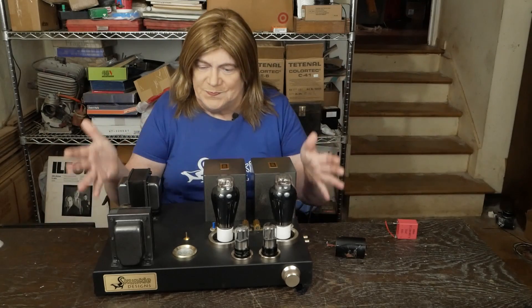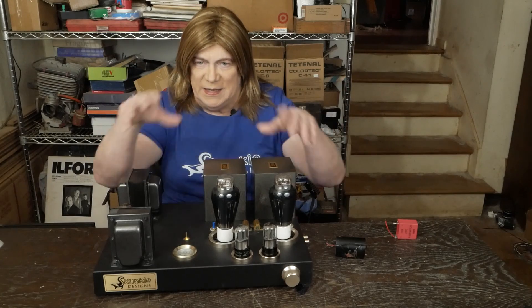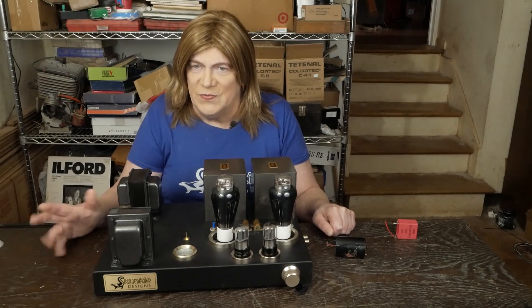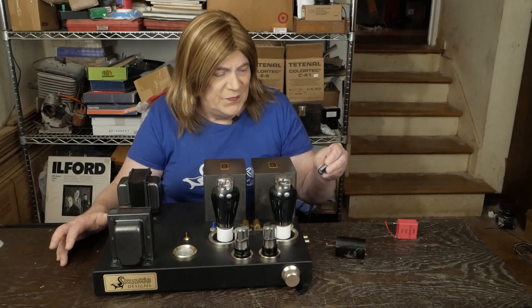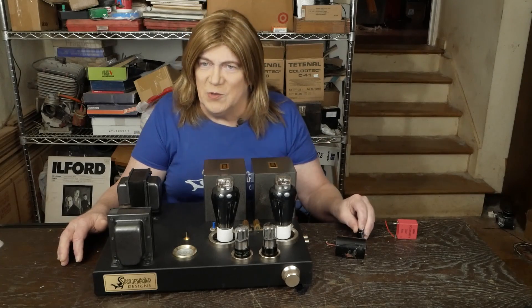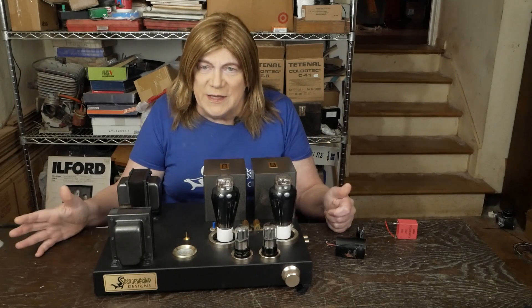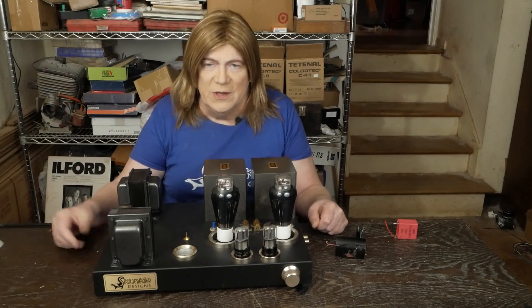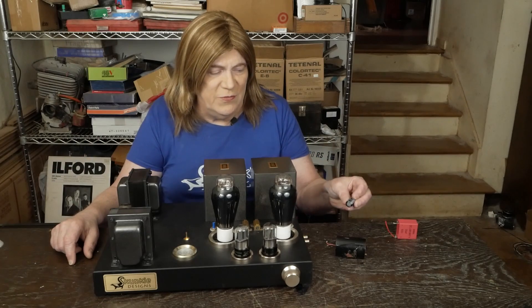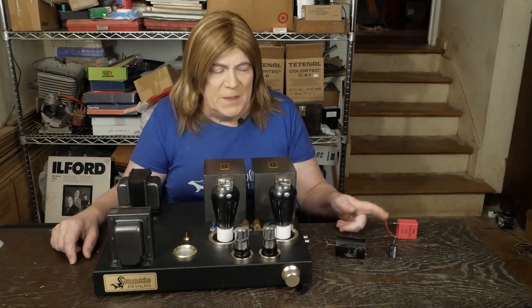When I posted pictures of the inside of the amp, somebody pointed out some cheap Chinese caps — Chenex electrolytic caps — on the front-end filtering. I figured they had a good point. I had nice high-end everything else; the other power supply caps were pretty nice JJ axial electrolytics and Nichicon. I looked through my stock and found a couple of 47uF 450-volt Nichicon caps, so I swapped those out before they could fail or cause a problem.